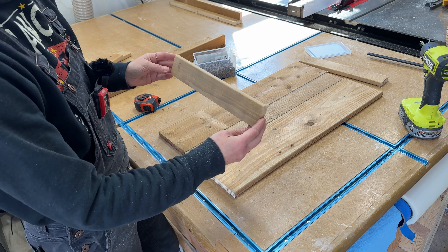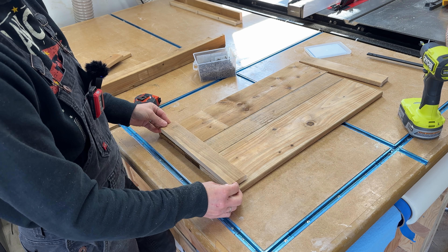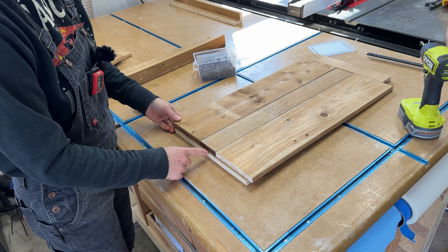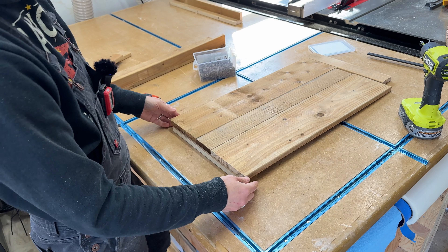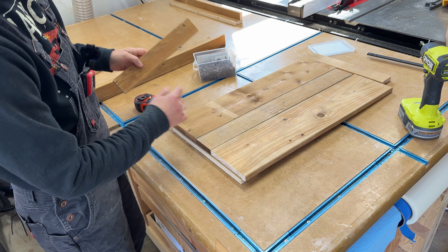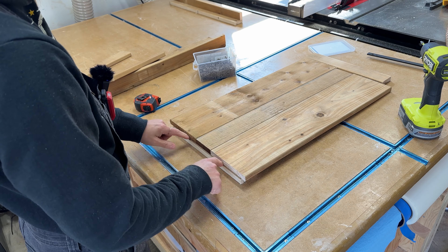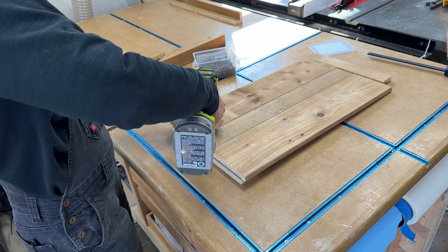Then we're going to take a piece that's 12 inches long and two inches wide and put it on the other side, underneath. We want it slightly exposed because these are again a little bit shorter than our distance. What's really important is that as you get it started, this piece has to be in the middle — when you get it over to the planter box it's going to essentially sit like this at the edge. I'll start by just getting them placed where I can see the end, and put one screw in just in case I mess up, so it's easier to fix.